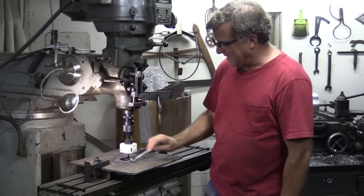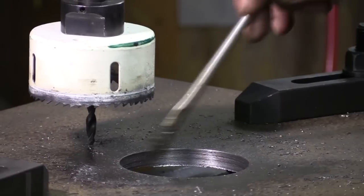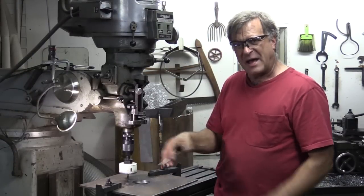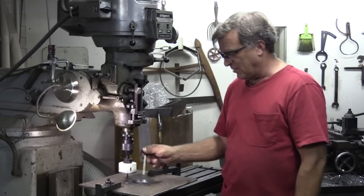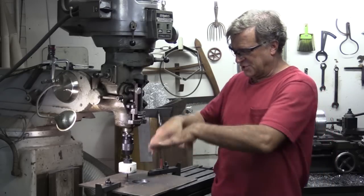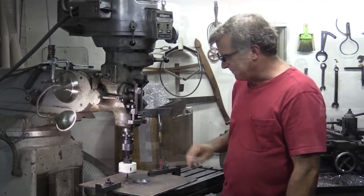Nice and clean and pretty, nice square edges, straight. I'll come in and grind this just a little to get shiny metal, flip it over, grind it on the bottom, bevel it just a little bit so when I set my tube down inside here I can get a nice clean weld on the top and a nice clean weld on the bottom. The dish will be set up on top of the pipe I put in — good to go, build it up from there.